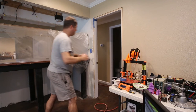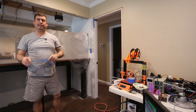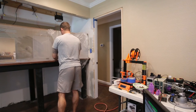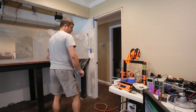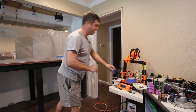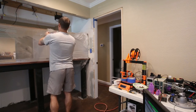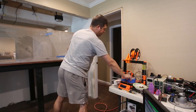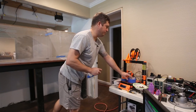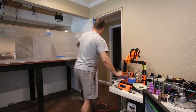If you have to put tape on your aquarium, you want to use the least tacky tape you can find — which happens to be this blue tape with the orange print from 3M. It doesn't stick to anything hardly, which is perfect because I do not want any residue left on my aquarium. Acrylic is very difficult to clean. On the top I'm not as concerned, so I'll use regular blue tape up there.